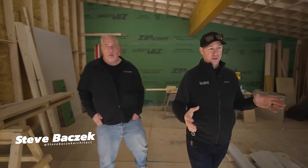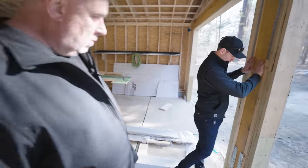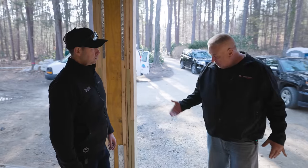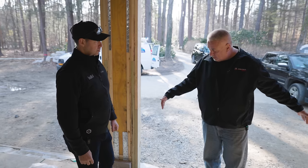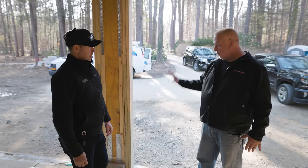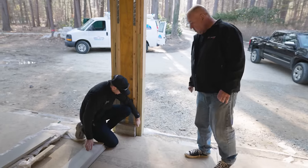The first thing I noticed when I walked into this garage is you've got two trimmers on either side of this column. Talk to me about dimensions for the garage, because this can be tricky for builders. It's a detail a builder taught me probably 25 years ago — he always wanted his doors oversized by six inches. He'd finish the door with two two-by-sixes, full treated, running all the way down for full attachment to the concrete. So if you're ordering an eight-foot-wide garage door, you're framing it at eight-six to the concrete.